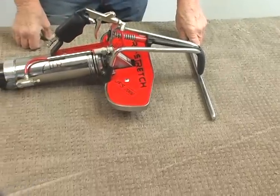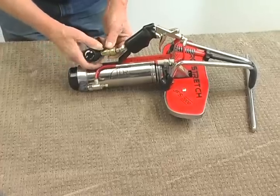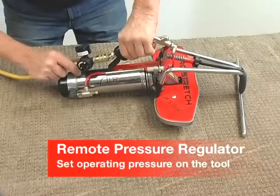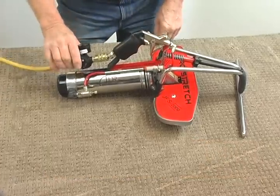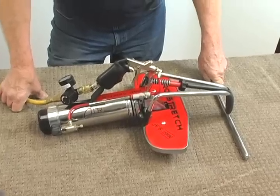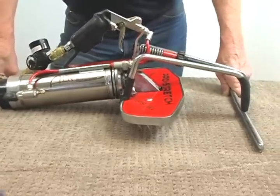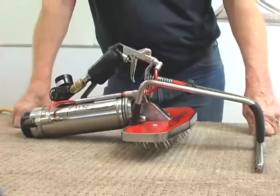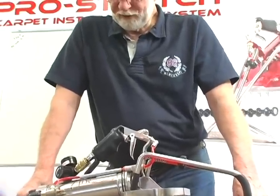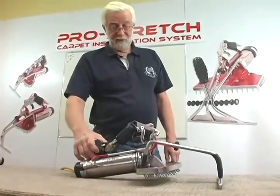This is the power unit. It's a must to have the air regulator — the remote air regulator on there. Leave the compressor up at its max; if you have a compressor that runs at 125 pounds, that's more than you need for most applications. For bigger jobs, you might want 150, and you can take what you need from there — they like to run at 120, 130, 140. We've never had any of these up past 140.